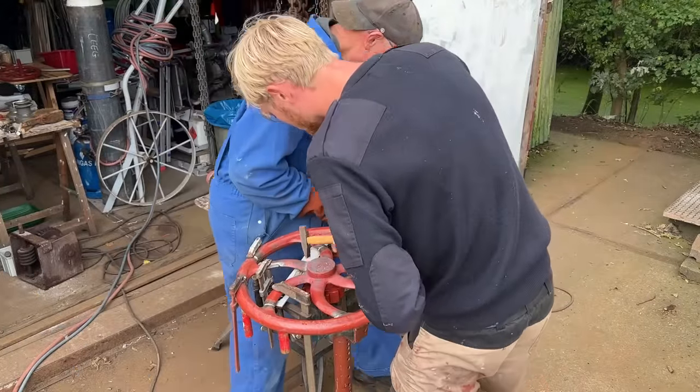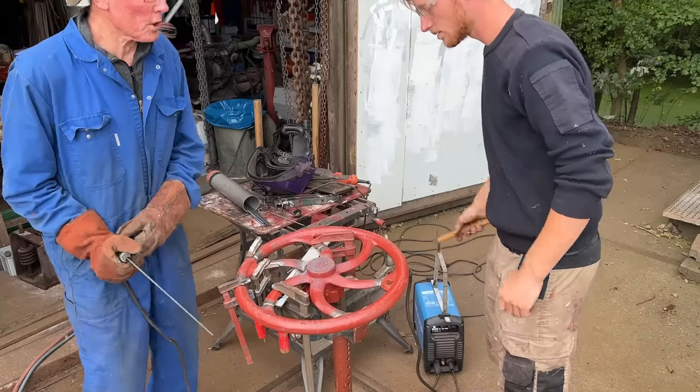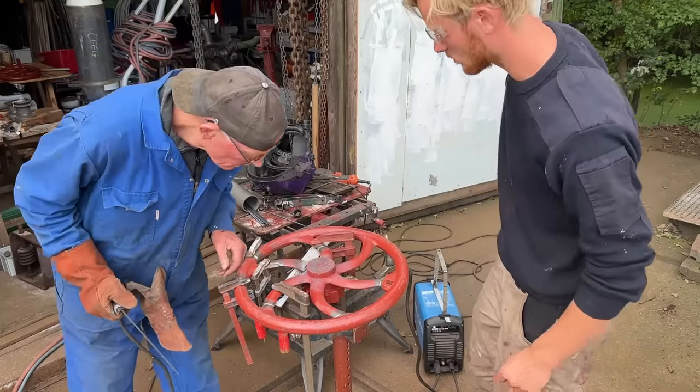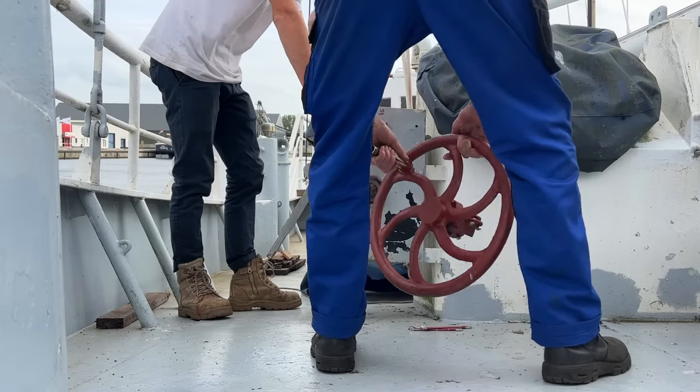After each weld, it helps to hit the weld with a hammer to release the tension from the material. When completely finished welding, the material should cool down slowly, so we wrapped it in towels for a few hours, after which it was ready to install on the winch.